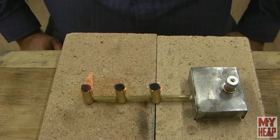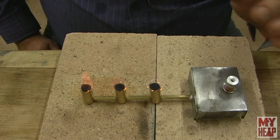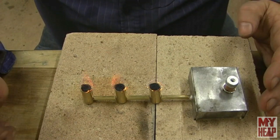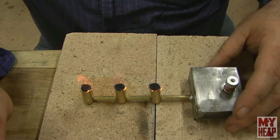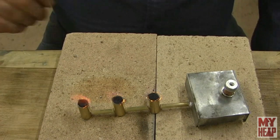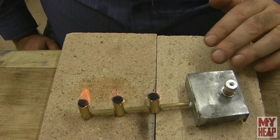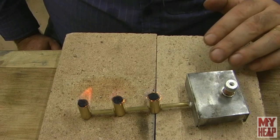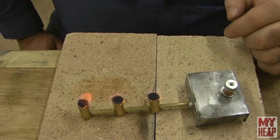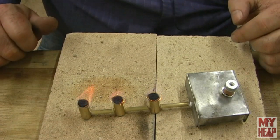So I'm still looking for some suggestions for some wick. So if you got a better idea or something, let me know. I'm gonna let this burn and see what happens. But Chirpy, you're absolutely correct, my friend. Steel wool will work as a wick. So, and it probably, if I loosened it up and pulled some of it out or something, I've got it, like I said, I've got it cut off about an eighth inch or less, 3/32 maybe, from the top of the wick tubes. But they all seem to burn about the same, whether it's the looser packed ones here or the tight ones. Like I said, I don't know if you can see that.